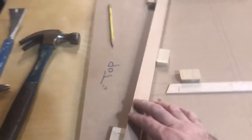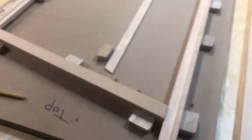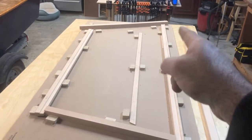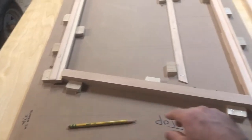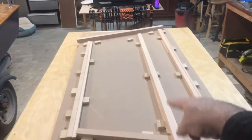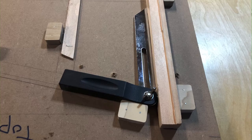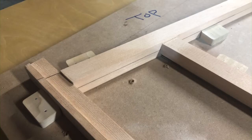The top piece has been cut and put in the jig. I still have some rabbets to cut out of it and some tapering to do, but I'm pretty happy with how it came out. The gussets go on here, and that's where this thing really picks up its strength — from the gussets, from my reading and research. Next, we're going to do the bottom piece, cut out the angles to fit it into the jig, taper it appropriately, and then cut the spar to fit in. Once I have the bottom piece cut, then I can cut that one.